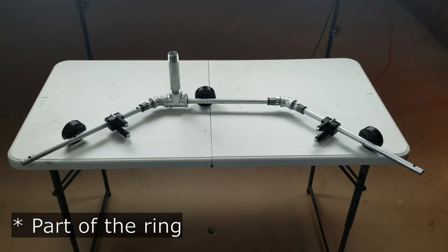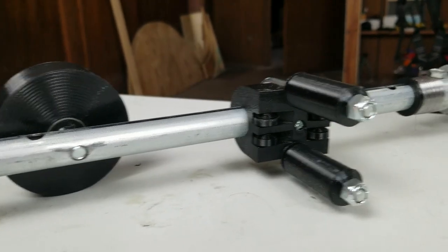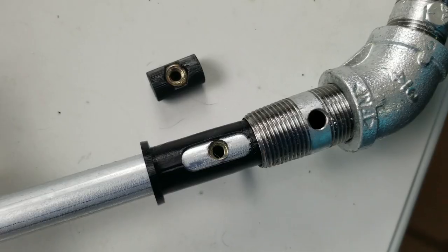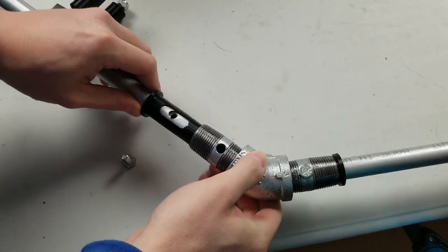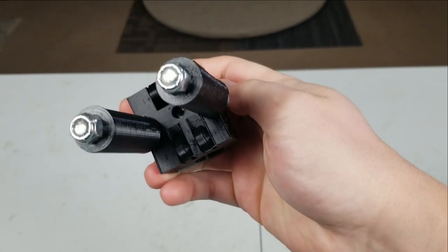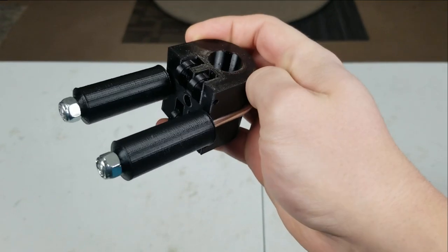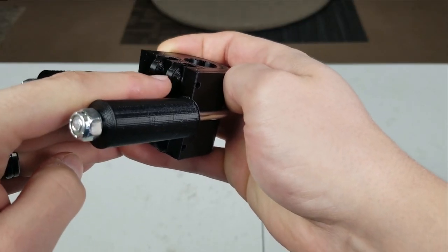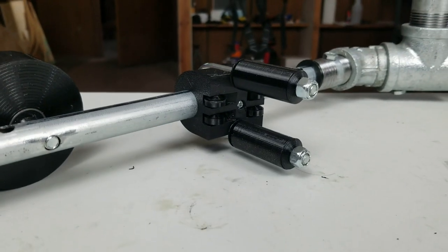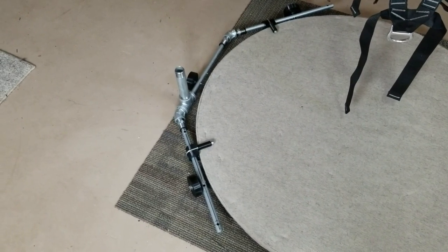This is so that I can make a sort of ring that grips the rim and rotates around it. This is the ring — or rather octagon — that rotates around the edge of the platform. It's mostly a combination of pipe fittings and conduit. The conduit is cheaper than longer pipes, so that's why I used it. The conduit is coupled to the pipe fittings via short pieces of pipe, with a bolt going through both of them and a 3D printed spacer. This part is the roller that grips the edge of the platform and rolls around it, with small rollers in the middle that roll directly along the edge. Additionally, it has a U-bolt that loops around the edge, with 3D printed rollers that spin, so the whole thing just fits around the edge of the platform.